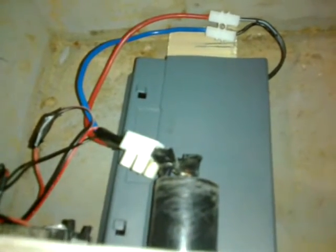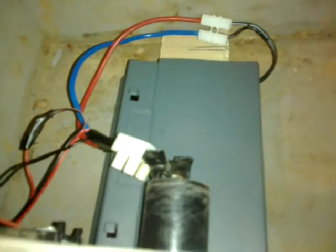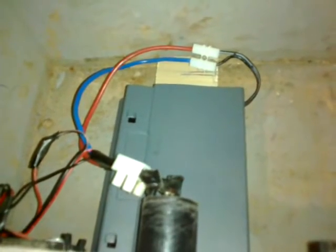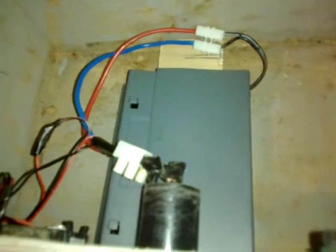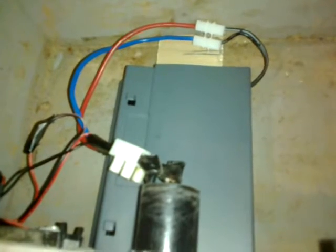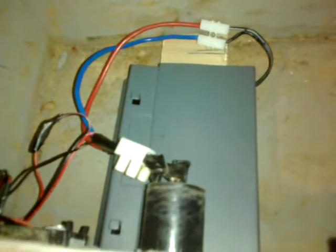This is only to charge your phone — it takes about half an hour — or to run LED lights, which will run all night. Ironically, my phone's just gone flat so I should really stick it on charge. So that's the update: I've taken out the big 12 volt battery for weight and replaced it with 10 1.3 volt rechargeable batteries, only 800 milliamps. But that's probably a quarter of the weight that the 2,800 milliamp batteries would be — so it's half the power of the decent rechargeables, but obviously half the weight.